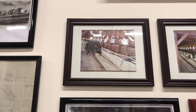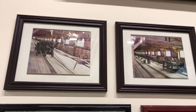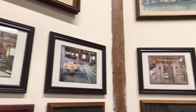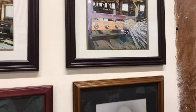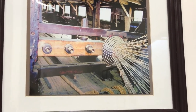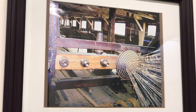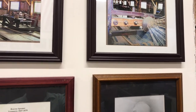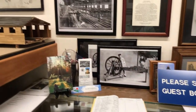And then we have these semi-colored photos, again of the rope walk when it was here in Plymouth. Here they're forming the yarns into what's going to be the strands through a forming block — it's like a sieve, a whole bunch of holes, and each yarn is fed through a hole depending on what type of construction you're doing. The common rope was a three-strand rope, but they also made four-strand.